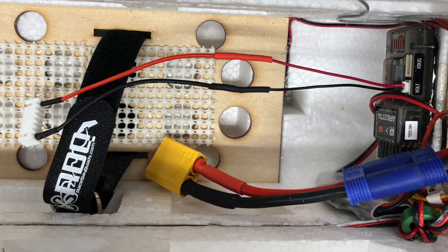Again, if you can get the one from Horizon, you're much better off. Another thing — you can solder this into your ESC or even into a BEC if you wanted to; there are a couple options there instead of using the balance lead. Keep in mind: if you do not know what you're doing on some of this stuff, don't do this. You're going to blow up either a battery or your receiver and you'll be very unhappy. So with all of those caveats, have a great day.